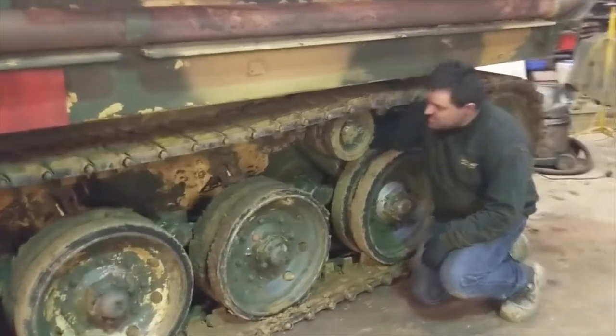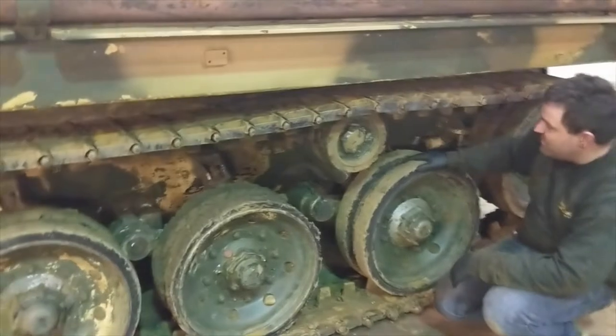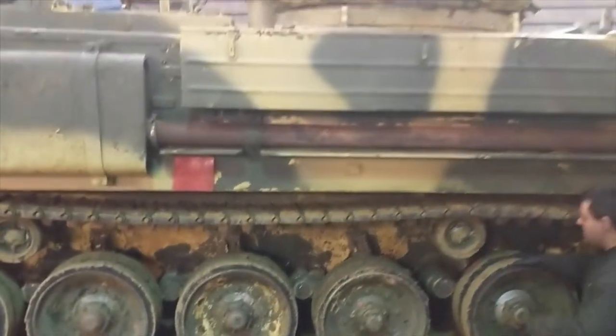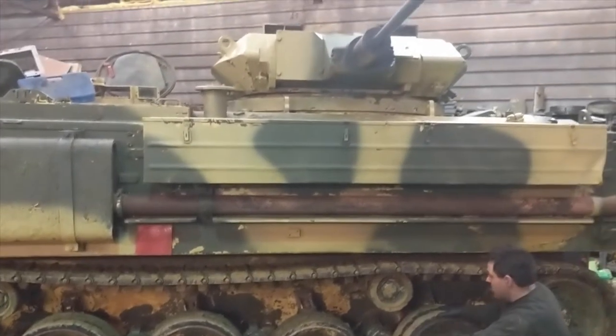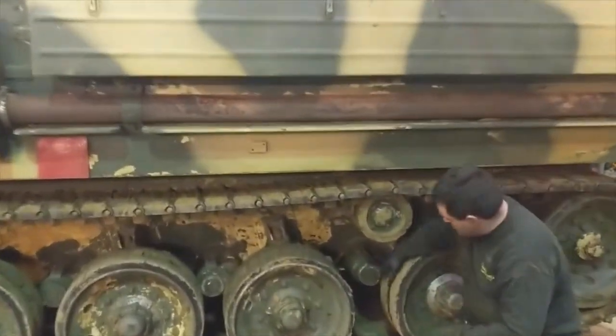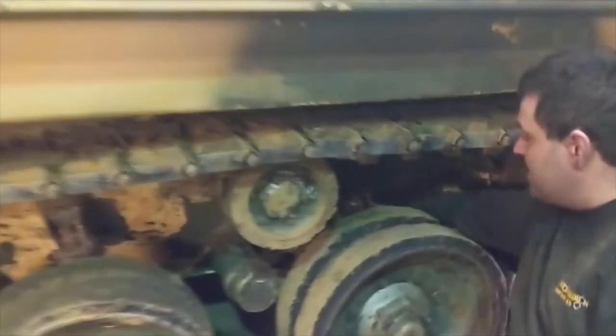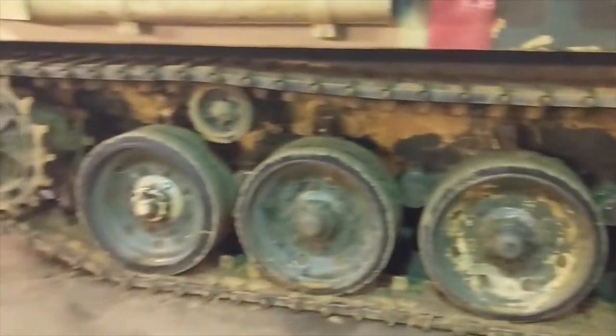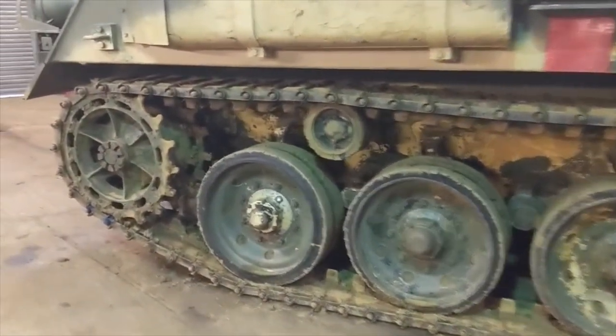What I'm doing now is just going through the running gear — checking everything: the track links, the track condition making sure they're okay, the wheels, the shock absorbers, and the elephant's feet, which are these individual pieces here. They're basically to stop the torsion bar coming down, making sure they're okay and intact. I'll then go straight up to the front and check all the sprocket area up there.